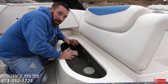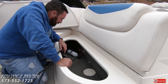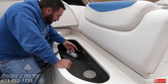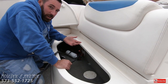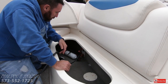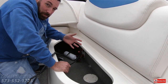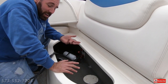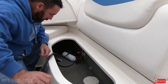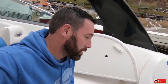There's a great feature here. When you want to get to your engine and your batteries are dead — which shouldn't really happen unless the boat's been sitting outside — you have a dual battery switch. When you go boating, turn the switch to all. When you're done, shut it off. If you're coved out, switch it to one or two so you've always isolated a battery. When the boat hasn't been run in a while and you've got rain coming in, the bilge pump is hardwired so it's always working the batteries. But you have an external port right here so you can hook up power, send juice to the batteries, and then raise the hatch and take a look at the motor.